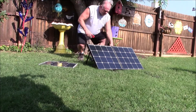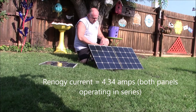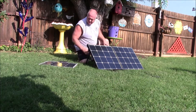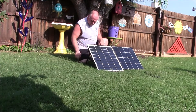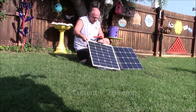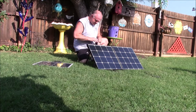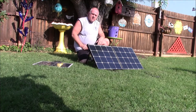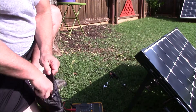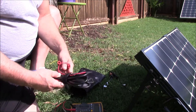A little frustrated, I decided to check the actual current off the Renogy panel. I got 4.34 amps with both panels operating in series disconnected. Hooked in the 50-watt panel — so you'd expect about half — and the current was 2.03 amps. So the Renogy was actually outputting more overall than that 50-watt panel if you double the power. I'm scratching my head, but okay.